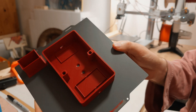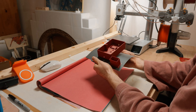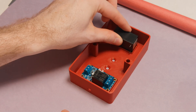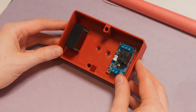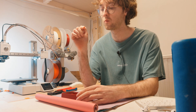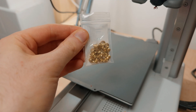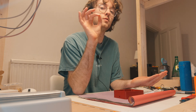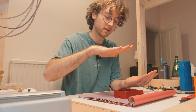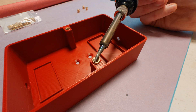These look pretty good. Now that I know everything in here fits just fine, I can move on to adding some threaded inserts into these holes and the wiring, which is going to involve some soldering and crimping. I've been told the best way to do these inserts is to melt them in almost all the way, and then with something flat just push them in the final bit — that way they should be dead level on the surface and not crooked.